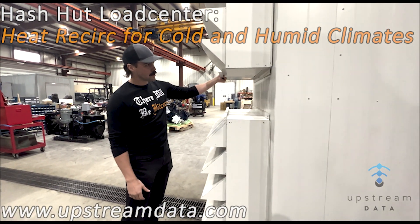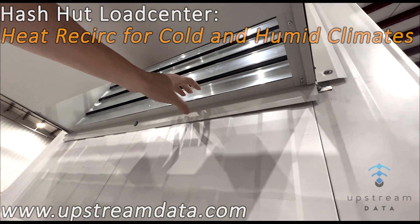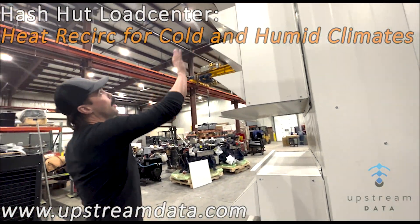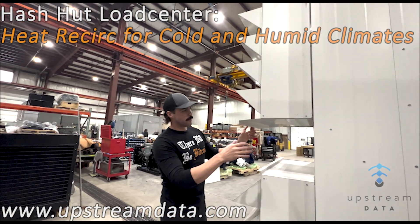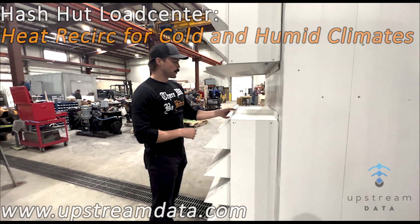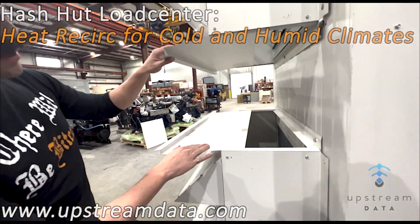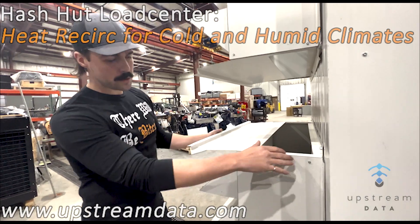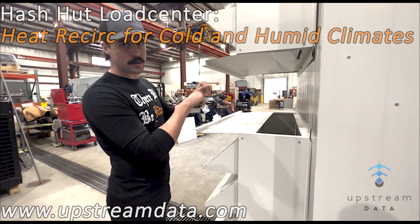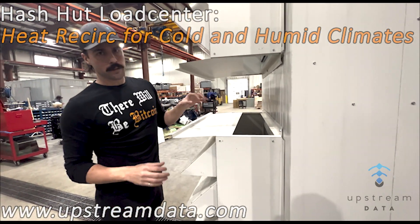Looking under here, this is currently a louver system. Normally the heat comes out and up through deflectors — these deflectors pump the heat up and away from the intake in summer. In winter, if you want heat to recirculate, you just open these and a bunch of heat pours back down into the intake. These are identical pieces, just flipped. This slider arrangement lets you short-circuit direct or mix with cool air, so you can adjust how much heat recirculation you actually need, which you measure inside the building.